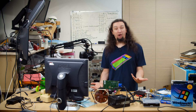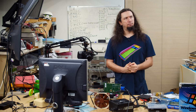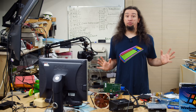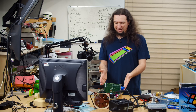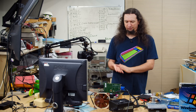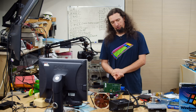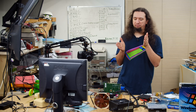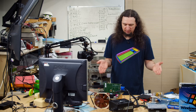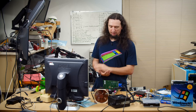Since I know this actually works, I went ahead and ordered some processors — I purchased some SL3PZs, or possibly SL3FZs, I don't remember which; they're basically the same and there are way more of one on eBay than the other. They're 533MHz processors, so I should be able to basically max this thing out. I know Celeron 300As overclocked really well, and 366MHz Celerons also overclocked well on this board. My goal is not really to overclock this — it's more to demonstrate an enthusiast-grade workstation-type build. I'm still working out coolers, which is part of why I don't want to run it right now as these coolers are not super ideal.